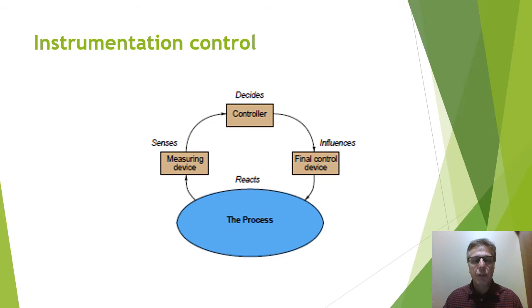We would have measuring devices to read the temperature of our fudge, and also measuring devices on the pipes coming in to the process, measuring the flow of material coming in. These measuring devices are connected to our controller. So when we hit the start button, the controller will tell the valve to open and allow some product to come in. The measuring devices constantly measure the amount of product, and when it sees the correct amount, the controller will close the valve, stopping the product from coming in.